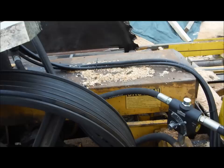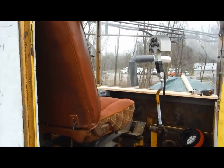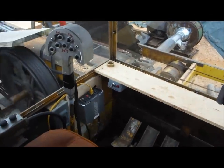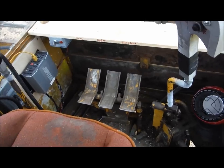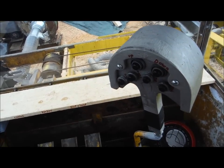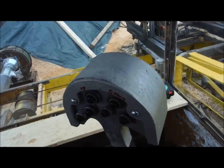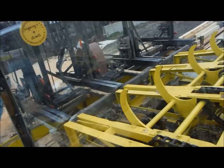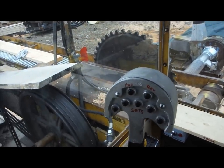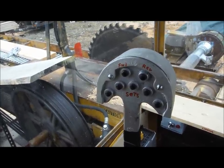This is the actual saw cab with all the controls that operate the whole entire mill. It runs off of two joysticks and there are three foot pedals on the floor which run the log deck. In my right hand would be the dogs — up and down, in and out — and then the stick moves back and forth and controls the log turner. The other stick, in my left hand, runs the set works — the bottom five buttons are board thickness presets.